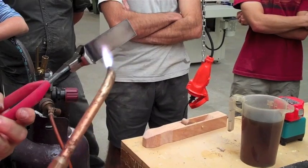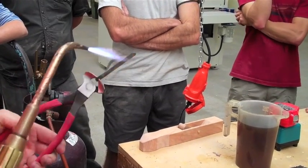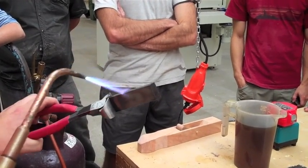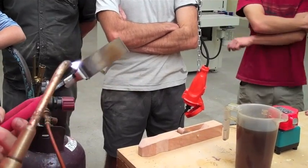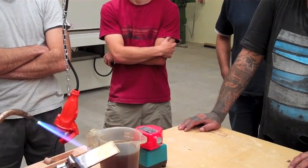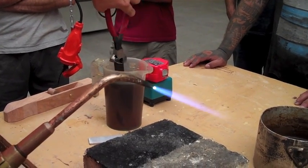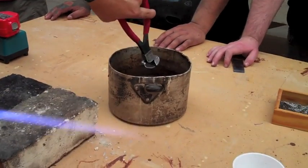You notice how far I'm holding the torch? I'm not going to put a lot of heat into it really quickly. Running it over all around the surface, not on one side at all times, otherwise it'll bend. We need to get the oven sorted. If you see the underside of that, let's get a little bit more heat in that area just to generalise it up. It's getting quite nice. That stops the process. And then back in there just to totally finish it off.